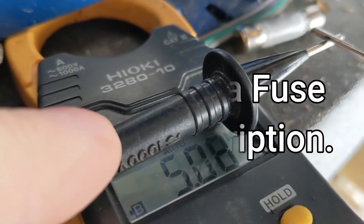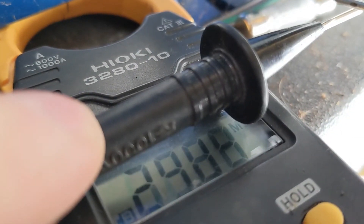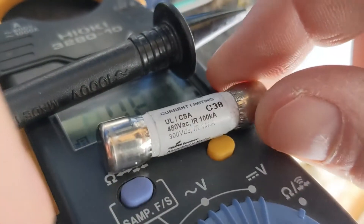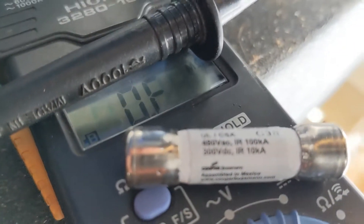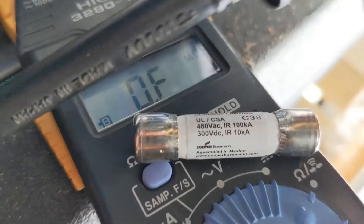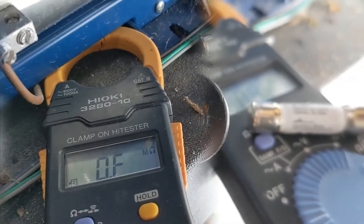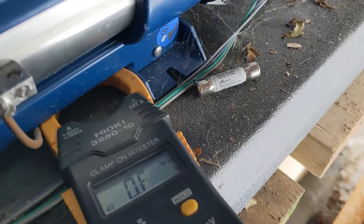So if I touch it — see it goes off. If I touch it now, the beeping on this meter doesn't work, but we can still test the fuse. If we have continuity through it, some sort of numbers should come up. If it doesn't have continuity, there will be no reaction. Sorry about the camera view — I only have so many hands, but I did test it.